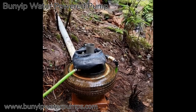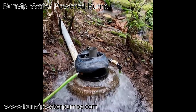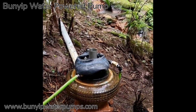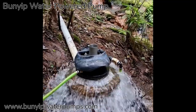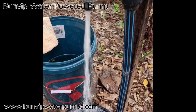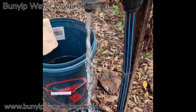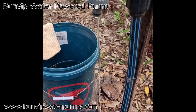This same pump can pump to a much higher head if there was a smaller piston installed on it — just like on a car you can put it into lower gear and drive up a steep hill. We can now pump to 400 metres. We've just beefed it up with a steel pump chamber and so on.